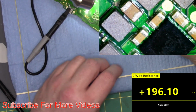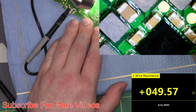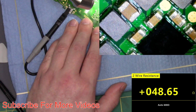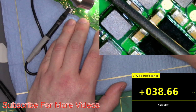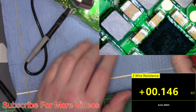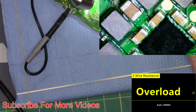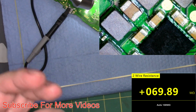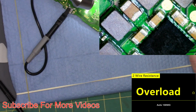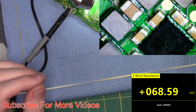Why is that? Oh, it must be charging and discharging or something. That is weird why I keep getting two different readings. So that's 49 ohms. So this could be a low voltage rail, like 0.9 volts. A very low rail, and it doesn't need that much of a resistance to ground to function. So if this is a very low voltage line that doesn't see a lot of amperage, that low of a resistance to ground could not be a problem.